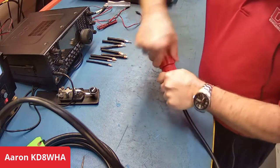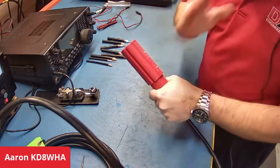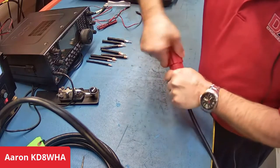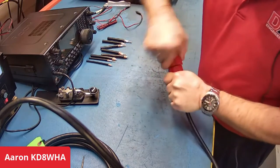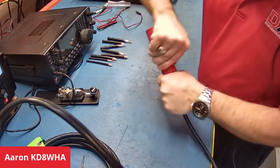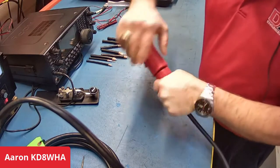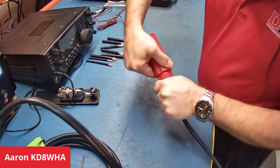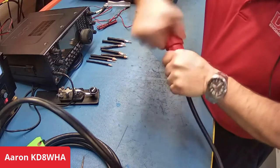What I like to do with this tool is a kind of sawing motion. You've got three blades flat up against the cable — you don't want to spin it or it won't do a proper cut. You rock it back and forth and work your way around until you hear the actual braid cutting underneath the tool.